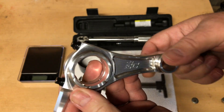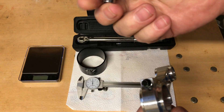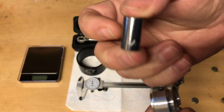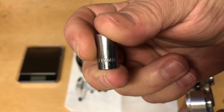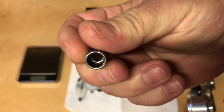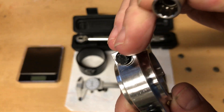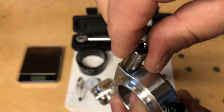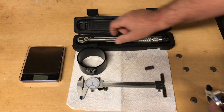If you're going to be working with these billet rods, these things have got like a 12-point rod bolt. Normally you'd want to get like a 12-point socket. Now this is a 5/16ths — that's not the size for the rod bolts on these. These are quarter-inch rod bolts. That won't fit — that's for a larger rod for a different engine build.